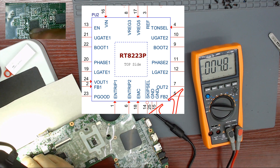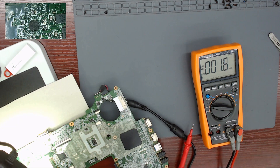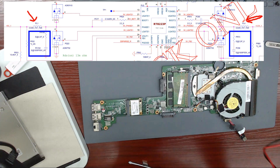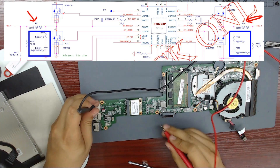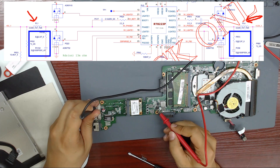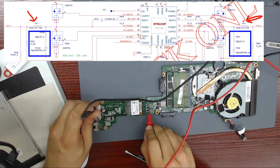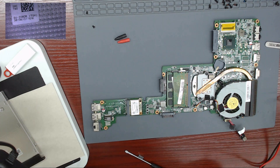Some of the signals are not present. Maybe the 3.3 volts power rail and/or 5 volts power rail is shorted. Let's test those power rails with a bench power supply — set to 1 volt, 2 amperes, black probe on ground, red probe on the coil. PL1 is on the 5 volts always power rail and PL4 is on the 3.3 volts always power rail. Found the short on the 5 volts always power rail.